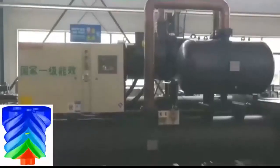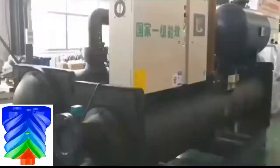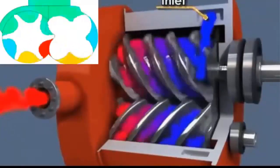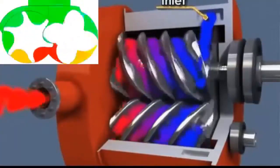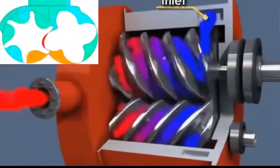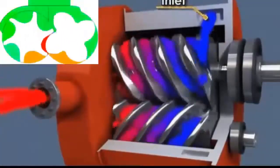With a fairly high level of life, especially when the condenser is cooled by water, it has a durability of many years. The screw compressor consists of two rotors, one male and one female, very close to each other with quite strict tolerance, whose operation is based on rotation for the progressive reduction of volume between both rotors so that the refrigerant inside these cavities presents a reduction of its volume. In the oil-injected screw compressor, the oil fulfills two functions: sealing — because the screws are not joined, they are separated with a tolerance — and cooling.